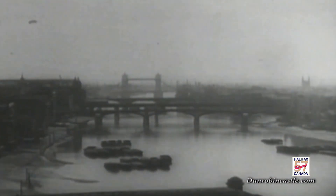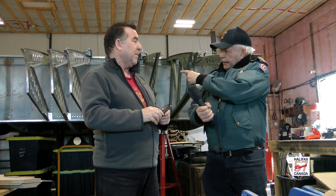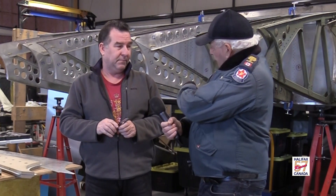It's the tooling in the shop that actually gives the part its real shape. The drawing is a representation of a three-dimensional tool. So if we've got the part, then we can make the tooling based on the part as opposed to the drawing. Here, in a simplistic manner, if you see the trailing edge of the wing and these ribs that support it, you see the curve there — it's best to have the original part, absolutely, plus the blueprint.